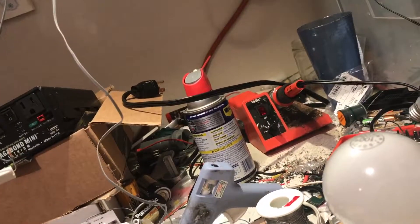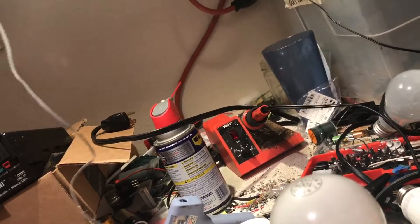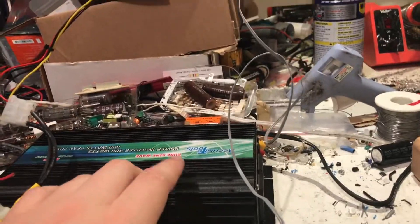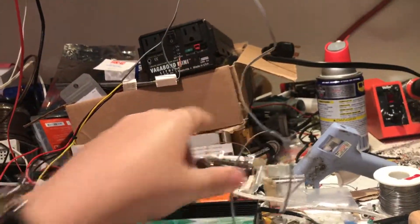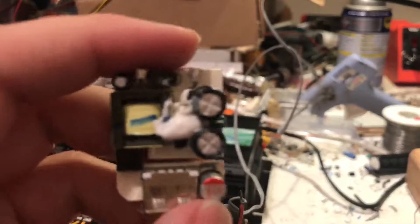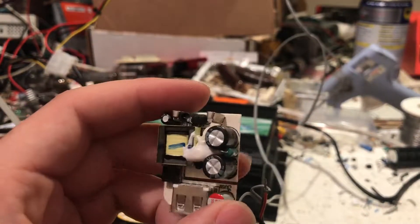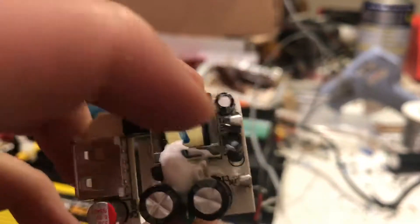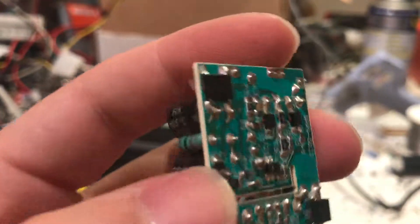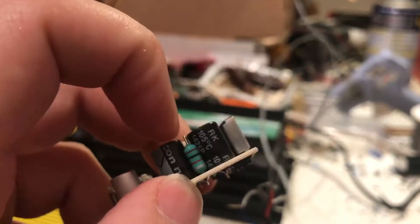Our grid voltage is really dirty — it's amazing. I know the AC waveform is dirty. I would have thought this guy would have been kind of a chopped-off sine wave, but nope — that guy's pure, pure modified, not horrible. Great for cell phone chargers. Here's the inside of a cell phone charger. I'll explain why you can run these on a modified sine wave. That's where the AC comes in — it goes through a fusible resistor in this case, then into a full-wave bridge rectifier, right there.